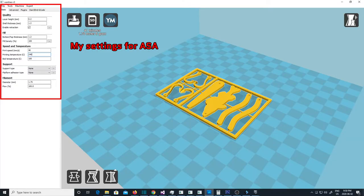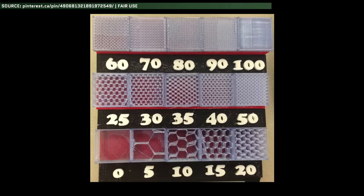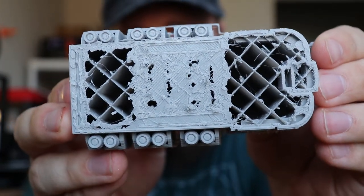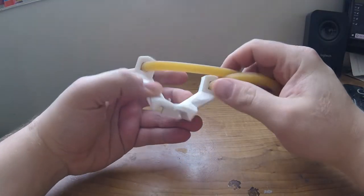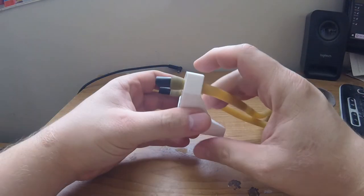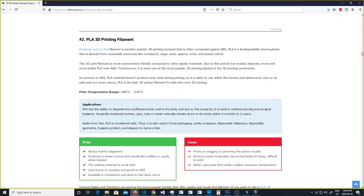As for settings, most are up to personal preference and the quirks of your specific 3D printer, but the important setting to discuss is infill. This controls how solid your print is: 0% infill is a hollow print, 100% is completely solid, and in-between values create varying levels of crisscrossing internal scaffolding. 100% infill gives the best durability but also weighs the most. I generally just go for 100% right off the bat. For my fishing snap card prototype, I'm using basic PLA — a simple biodegradable corn-based plastic — for testing until I finalize the design.